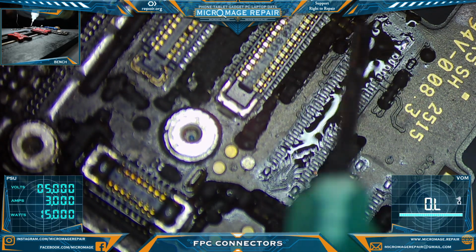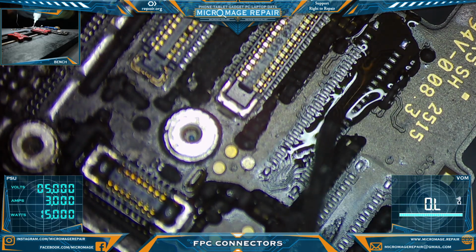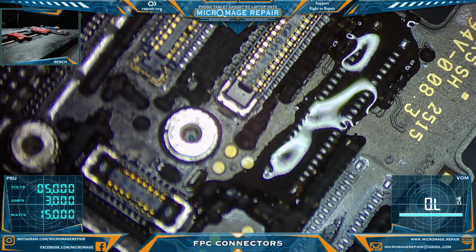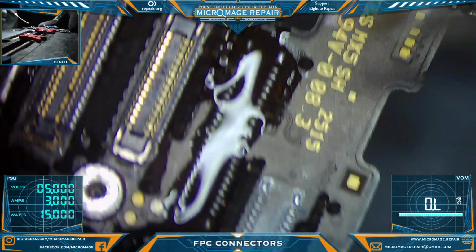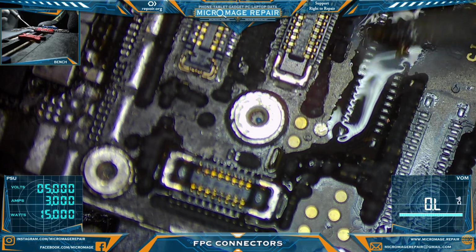All right, let's go over placement. I'm just going to mix in leaded solder and try to flatten out the anchors as much as I can. The anchors are what can be really problematic about placing a connector like this. So I'm just going to mix in some leaded.